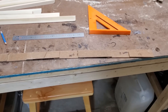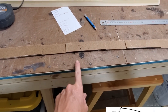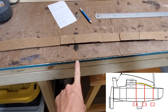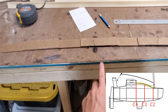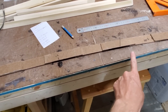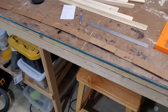I've laid my template out on the work table, which has a straight edge. Basically where frame C3 is in the middle, that's my baseline — that's 55 millimeters up. C2 is going to be zero on the Y-axis. C4 is zero on the Y-axis. And then I took two measurements, 30 centimeters left and right of C3, and measured how high up it is. From that, I should be able to make a good enough mold for the center panel.